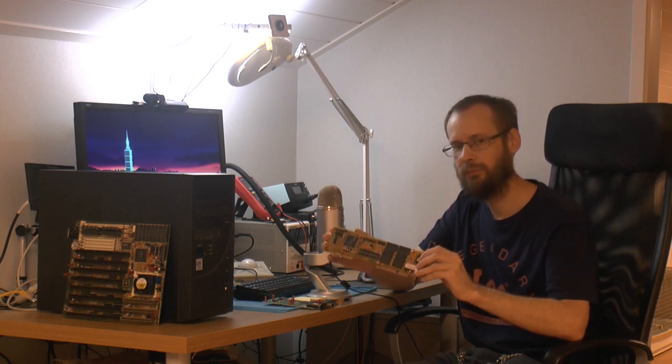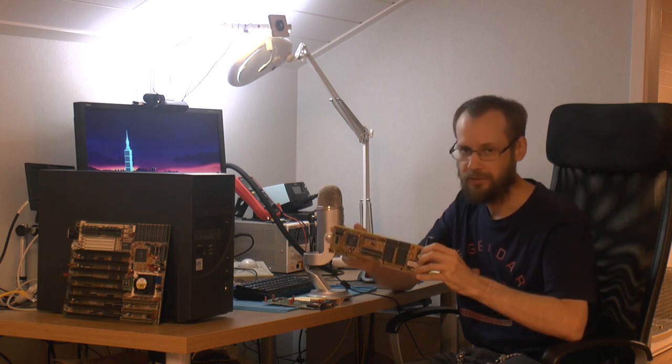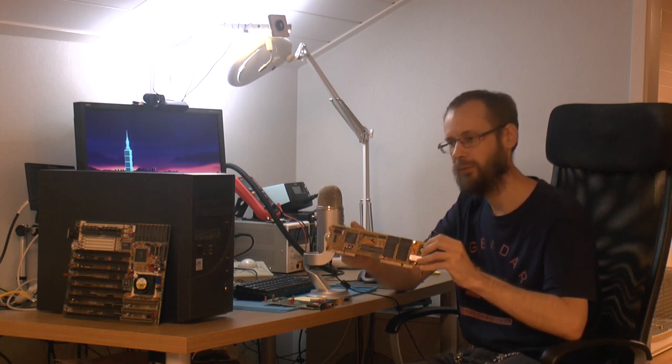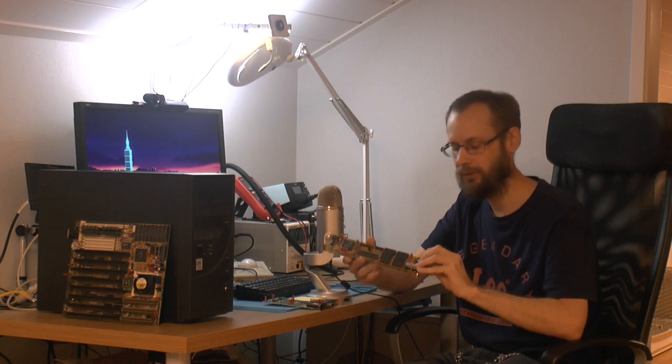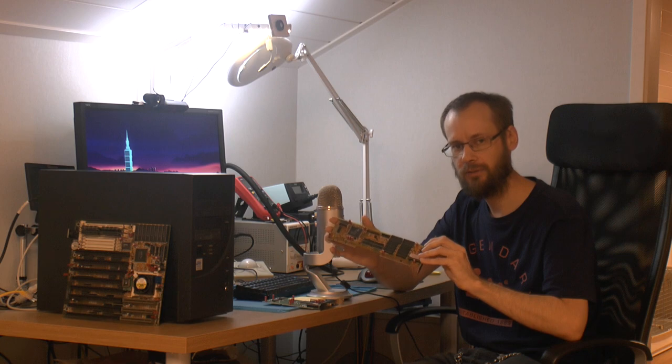So we weren't comparing VESA 1.0 to 2.0. So if you saw my original video, that was wrong. The test is still valid. My whole point of the video was that if you don't have VESA 2.0 on your graphics card, you can have it on your ROM if you support it. But if you don't, you can load something like UniVBE.